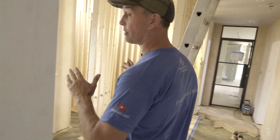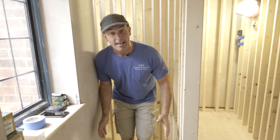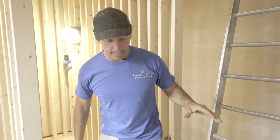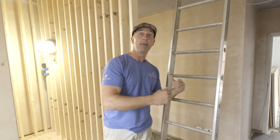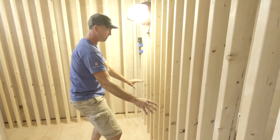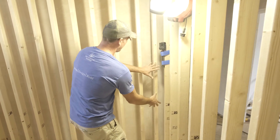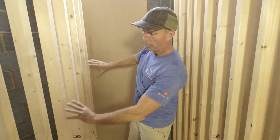As you can see, I've started to construct the staircase. It's actually starting from here and then coming all the way up and turning all the way up to there. This is classed as a left-hand staircase — the inner leaf, or inner string, is going to be curved. The outer string, which is going to be here, is square. The string line will come all the way along this wall, then from here go all the way up to the top of the trimmer, and the inner part of the string will then curve all the way around.